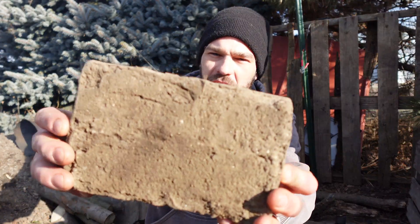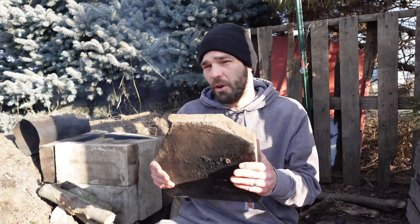All of these bricks I've been showing are still green bricks — and I mean green in the sense that they are unfired; they still have LOIs or impurities in them. All of our bricks are straight up and down so the air can move through, the heat can move through. We're going to start firing from the top so it can burn back down. I have a brick that I'll slide over the top to basically cap it and have a real kiln with a hot inside completely protected from outside temperatures or atmosphere.